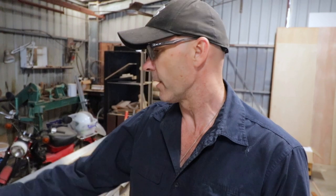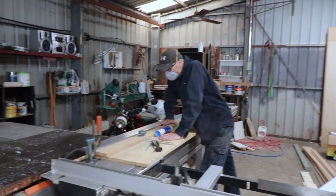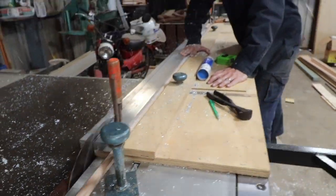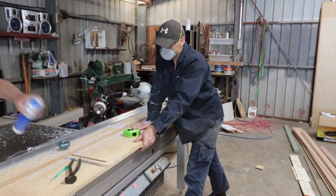We've got a big billet of aluminium to cut - it's 100mm by 25mm thick solid aluminium. The saw will cut it, we just need to hold onto it. I'm cutting a 38mm taper to follow the shaped sides of the bus onto what will become structural bracing for three new slide outs. These will be welded into place once the roof is raised.